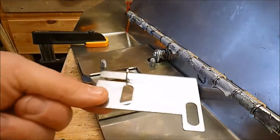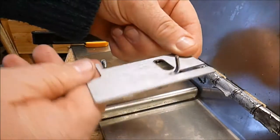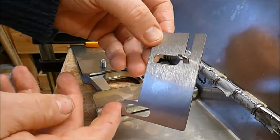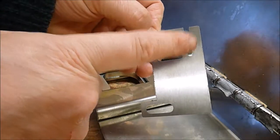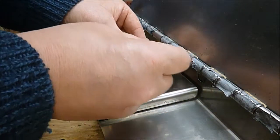Next thing to fit is the plate with the elongated holes in it. As you can see the small tab needs bending upwards. Just make sure it comes up so that this long slot is at the bottom and this is pointing out of the page. Then we fit it onto the lock.